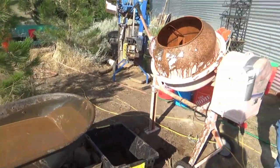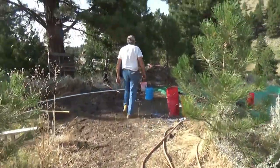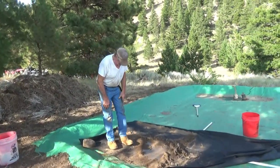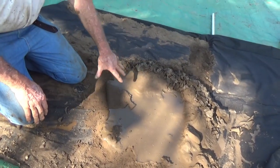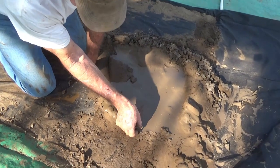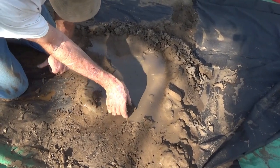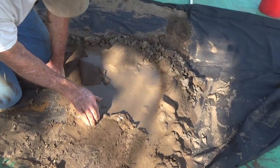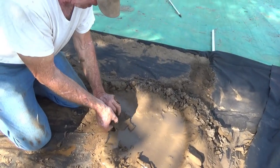Now, we just poured this slop in this test cell — this was built up with tailings from before. What happens is the coarser material sinks to the bottom real quick, and then the slimes settle on top and form a layer. That layer is not going to be very permeable, so I'm going to go ahead and peel it off and put it in a bucket for now.